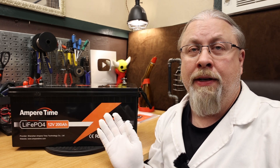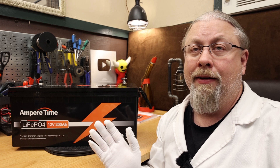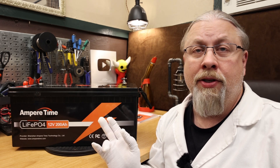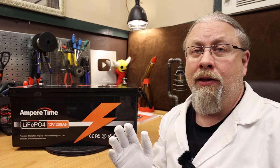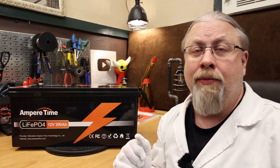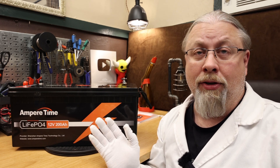What's the use case for these batteries? Obviously you're not dropping this into a car — these 100 amp BMSs cannot start vehicles, so don't buy one thinking you'll start a car with it. You could run a small trolling motor on a boat, but that's about it. For a constant load it has to be under 100 amps or 1280 watts. The recommended inverter size for a single 200 amp hour battery is around 2000 watts. You still want a 2000 watt inverter to handle the surge — if you're plugging in an air conditioner or refrigerator with a startup surge, get a slightly larger inverter than the battery can handle. We've seen this can handle surges up to 300 amps for short periods, so it doesn't hurt to get a larger inverter.